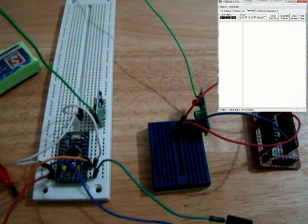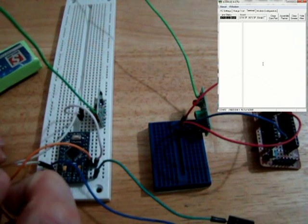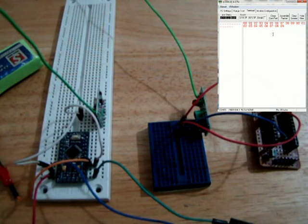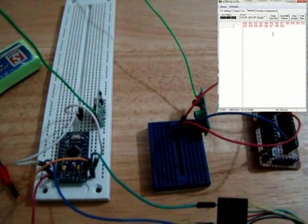And what we're going to see is, on this side we'll see the ASCII value, and on this side we'll see the hexadecimal value. So we should see 0 to 9 appear when we give the Arduino power. So let's do that. We'll connect the battery now. Okay, now you can see the values appear in here. Get to 9. Now we're waiting for the 5 seconds. And then it should cycle through again and count to 9 again. Yep, here we go. Okay, so we see that our program works perfectly when we are directly connected